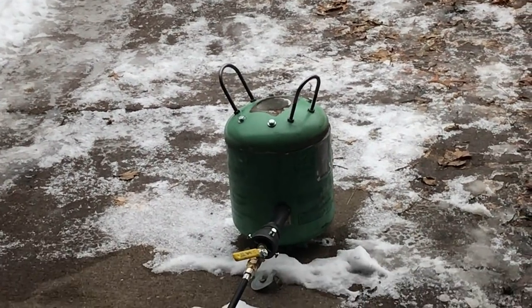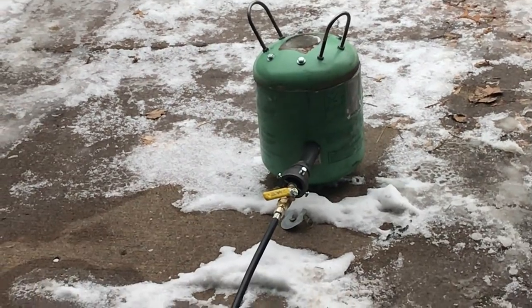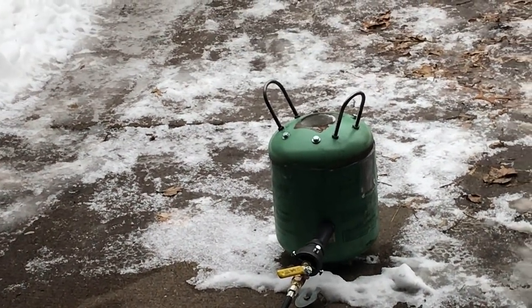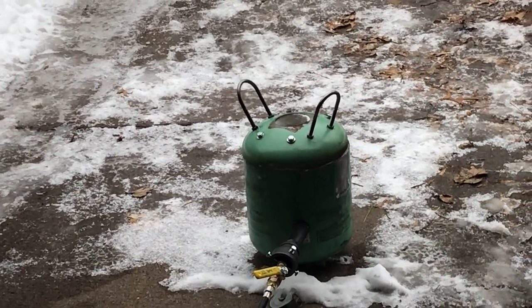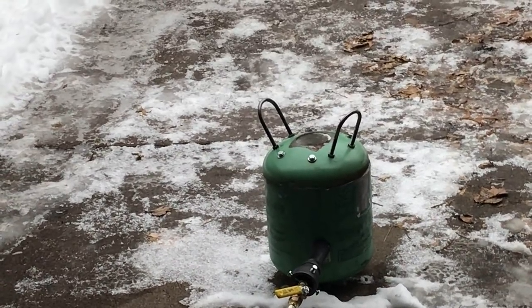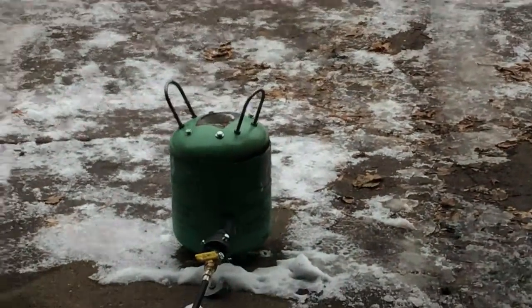I'm a little nervous about it because A, I built it, and B, I keep hearing this poof, poof, kind of a fluttering sound, then a poof. Like that, right there. I'm not sure if it's not getting enough gas, or too much gas. Did I build something wrong? I don't know. Once I feel everything is warmed up, I open up the regulator to full and hope to melt some copper.